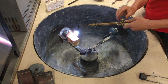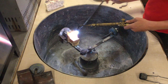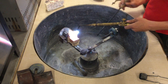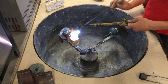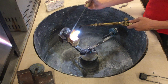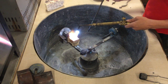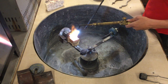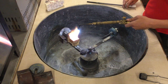I'm going to turn my oxygen down — you want a reducing flame, just slightly reducing, so I'm lengthening my cone. When you first light up the torch, sometimes a little bit of atmosphere or oxygen needs to bleed out, causing variance in the uniform flow of your torch head. Ultimately, you want to see nice clean cones — not changing in size, with no soot. The flame is captured outside of the crucible so it bounces in the bottom to heat everything up, with just a little cover flame coming out. That ensures no oxygen is present in the atmosphere to burn the metal. If the metal burns, it makes it harder to get your flow dynamics right, and there's a lot of scrubbing to get your metal back to shiny.